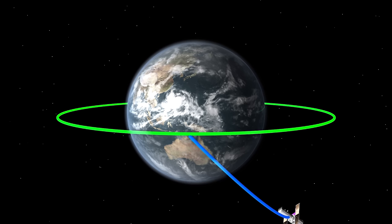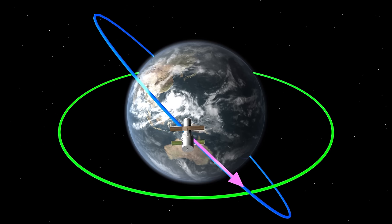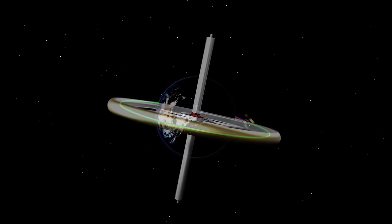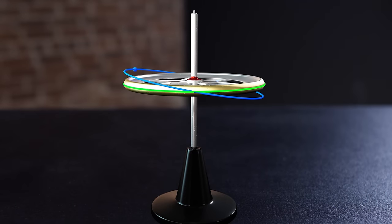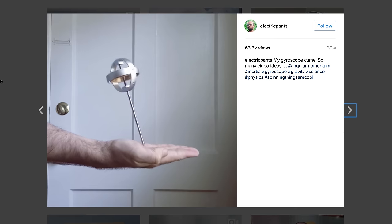Just like with the ball, a downward force won't send it straight down. Instead, the vectors combine, resulting in a new path. 90 degrees ahead, it reaches the maximum distance it will travel in the direction of our force before going back. The key point here is that a downward force at this location didn't move the orbit like this — it moved the orbit like this, tilting it 90 degrees ahead of where we acted. Now imagine the satellite as a small piece of our gyroscope. Pushing down here will cause the piece to assume a path that would take it like this. But since the disc is solid and all of its pieces rigidly push and pull each other, the gyroscope itself tilts like this. When the gyro pivots around a point below its center, if the gyro wasn't spinning, pushing it down would have just caused it to fall. But when something is spinning, its component parts have other vectors you need to consider.